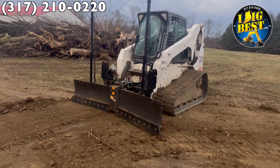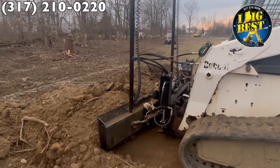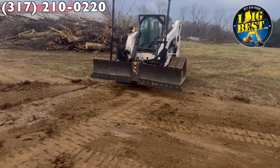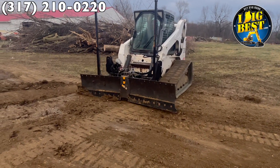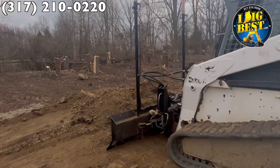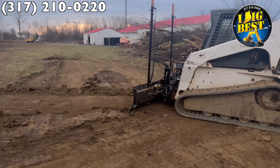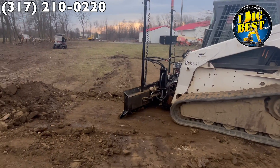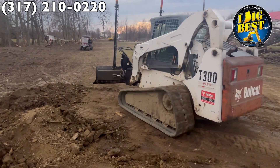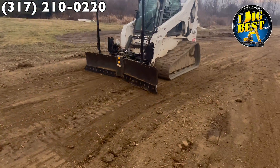The ability to grade under movement is key — all I do is back up, leave it down, and grade back and forth. With the laser, I can pick it up in the air, and when it gets out of the laser or GPS range and then I set it back down, it goes back to grading again. You can see it cutting — this is the hardest clay, the worst or best example for a dozer grading across the ground. You can put anybody in this thing and start cutting pads, swales, planes, roads, steep banks — anything you want.